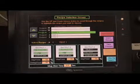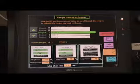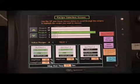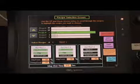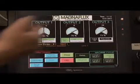From here, push the Transfer Current Manual Settings to Highlighted Recipe button, and this moves the parameters currently set up in manual mode directly into the recipe that is selected on the screen. The outputs that were turned on or off, as well as the magnetizing and demagnetizing power, along with the Magshot Time, all transfer and are now reflected on the recipe selection screen. Press the Save Changes button and then the Go to Main button. The recipe selected is now shown on the main screen as active.